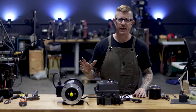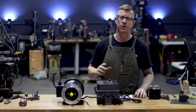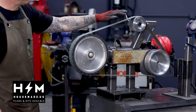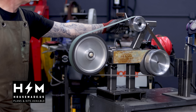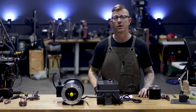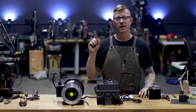This is the best way to do it. When I started this journey understanding motors and variable speed drives, I was using DC power and open motors, but eventually — buy once, cry once — I went to a totally enclosed fan-cooled three-phase 220 motor with a KBAC unit, because I just wanted my machines to work reliably and efficiently. That's why I developed this system. If you got something out of today's video, hit that thumbs up, subscribe, and check out housemade.us for parts and support. My name is Brian House and this has been Housemade.